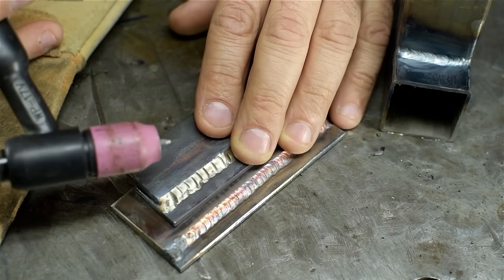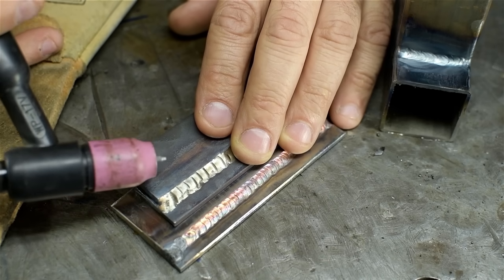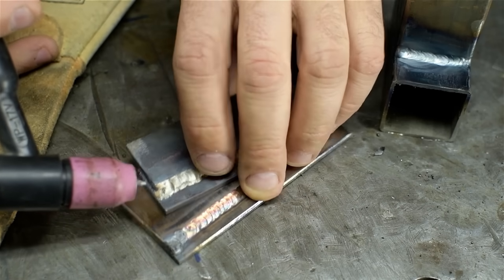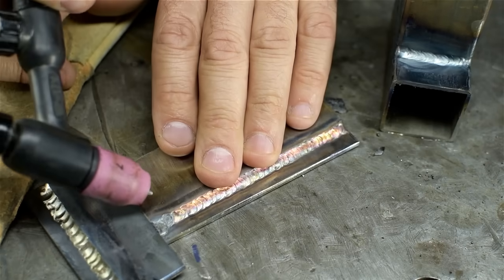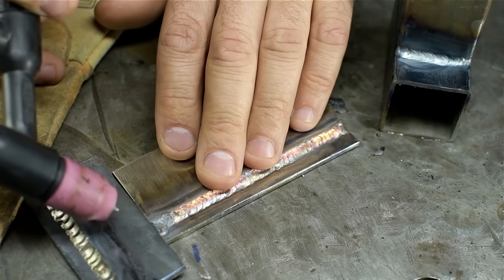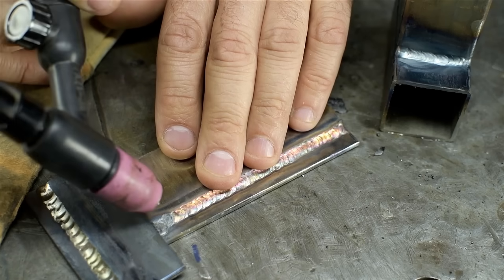But plenty of TIG welding still happens with scratch start these days. Environments where you can't have high frequency. Quick tip if you're doing something important. Start off with a piece of scrap near the part that you want to weld. Do the scratch start on that. If you have a piece of copper, I think that's even better. And then pull the arc onto your work.